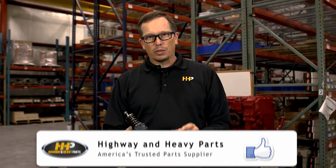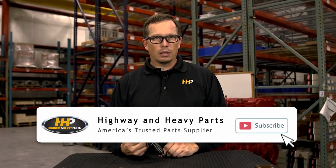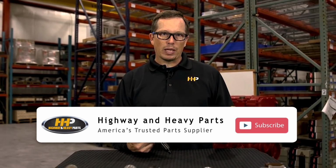If you're chasing injectors on an N14, just from personal experience, a lot of times you may replace one, 6 months later you replace another one, 6 months later you replace another one. It's been my experience that N14s are best done in full sets. That's going to give you the smoothest, best operating engine that you could ask for.